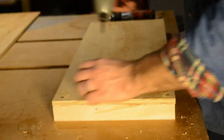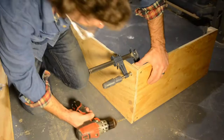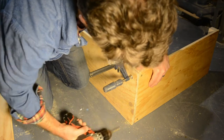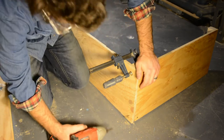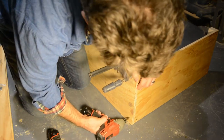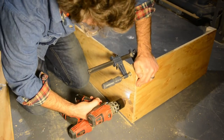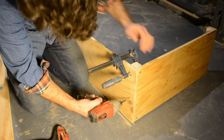It really won't mess with the structural integrity too much. Then you're going to clamp your ends to your long sides and use a drill with a small bit to make pilot holes to minimize splitting. Again, you're doing three screws aside, all the way up, and you get all four corners assembled.